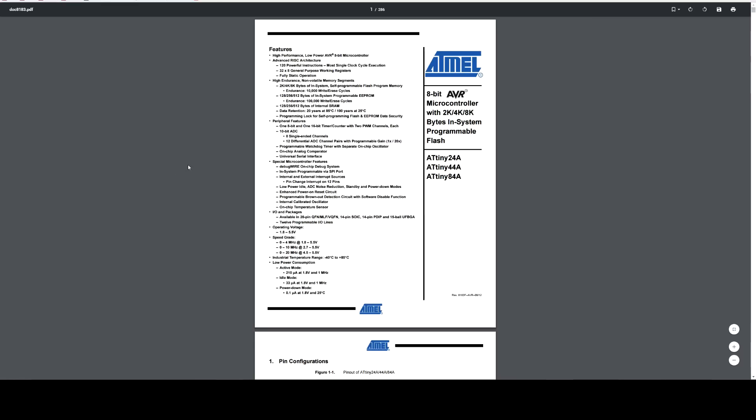Here's the microcontroller I chose — the ATtiny24A. Basically what I did is looked at Farnell, my primary component supplier, and selected the smallest possible microcontroller that is still solderable by hand. My idea was to make this a project that I can sell — I can even sell kits and people can still solder it by hand without needing stencils or anything. And fundamentally what I did wrong here is I didn't thoroughly check the datasheet and didn't check whether this microcontroller had sufficient timers, because this microcontroller only has one 8-bit and one 16-bit timer.